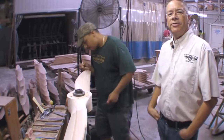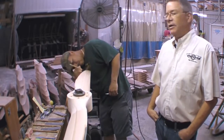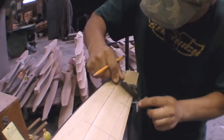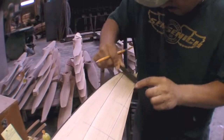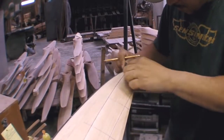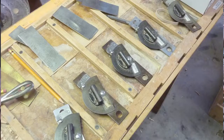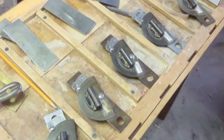Even though the propellers are CNC profiled, they still need hand finishing and hand work. The propellers are hand carved using spoke shaves and sandpaper. We utilize airfoil templates to maintain template fit and protractors to maintain blade angle on the backside of the prop. All the while, the propeller must maintain balance and be carved to within a balanced tolerance.